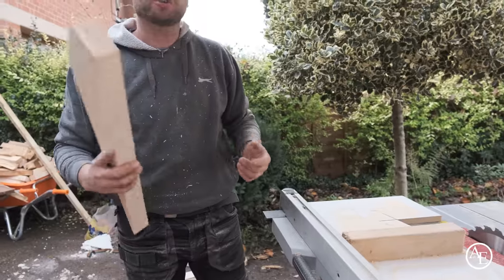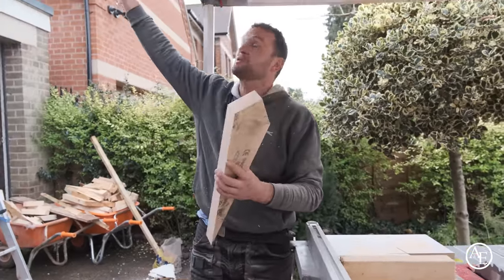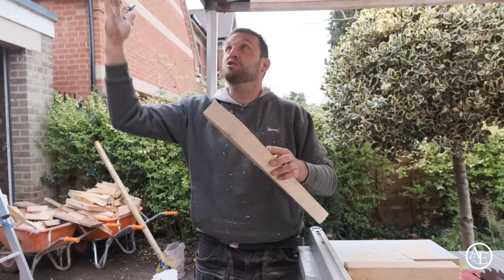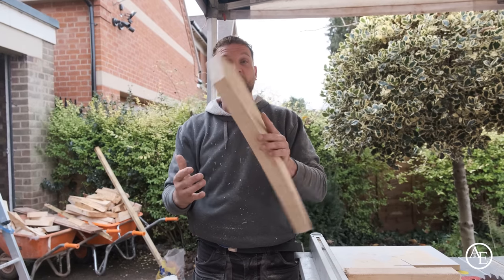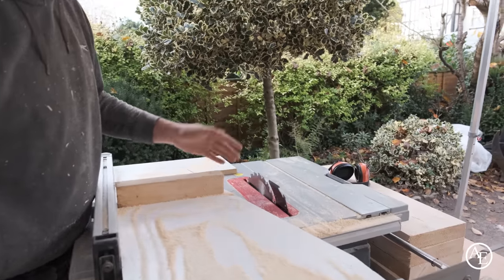We did have a load of sprockets machined up by a local woodworking firm, but unfortunately, because we're now onto a 300mm cavity wall, the original ones were set for a 9-inch wall, so obviously we've got to machine some fresh ones up. For the sake of speed and mass production, I've made this jig.